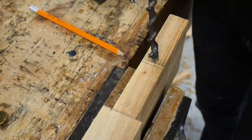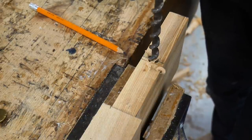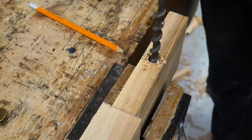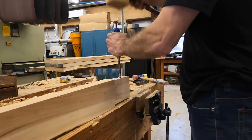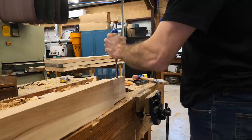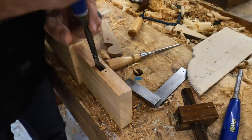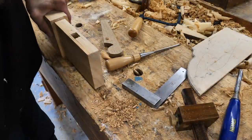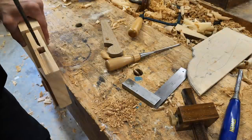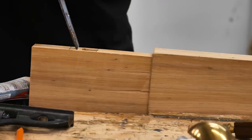So come back through and take out the rest of that waste and then I'm going to do most of the work from here on out with a chisel. It's hard to explain exactly, but this is an angled mortise — you have a straight edge and then the other opposing edge is going to be tapered to match the taper of the wedge, so you've got to just do that by hand. I need to build out the mortise to the width of where the taper meets at the bottom and then come over and start cutting the taper — basically a half inch by about five-eighths or three-quarter mortise. It's actually quite a bit of work because it's such a wide tenon, so you want to make sure you're keeping everything straight.